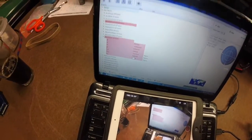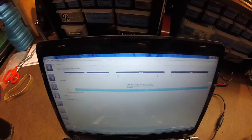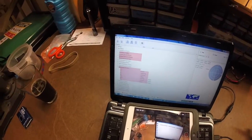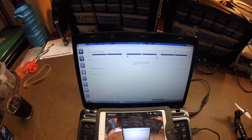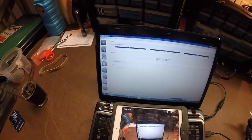So we need to make that negative 10 degrees. Go back to your configuration, and then go to pitch. Because I left the page and went back, it actually already updated for me. It's negative 10. You have roll, mine is 0, and my yaw is 0. I don't have any issues with that. It's just the pitch. Change pitch to negative 10, and then save that. Once that's saved, you can go back to System, go back to Attitude State, and that didn't update. That needs to change. So we're going to go back to Configuration, zero that, save it, and level it.